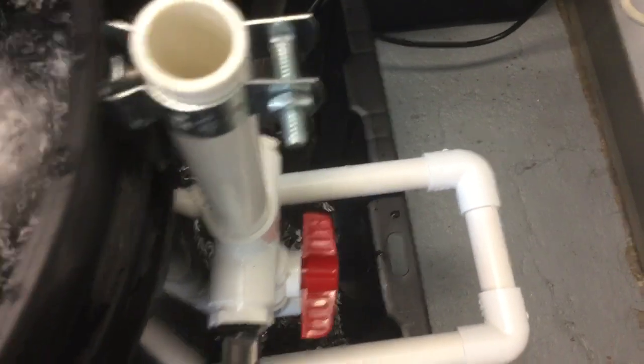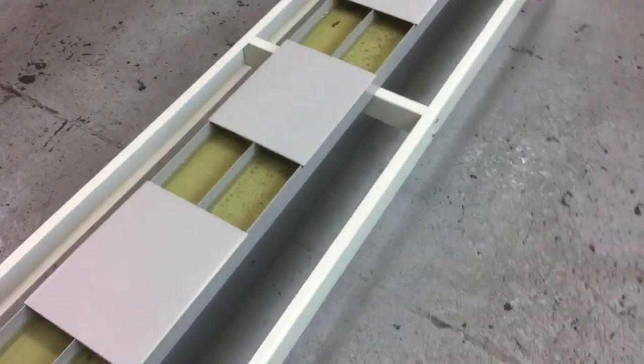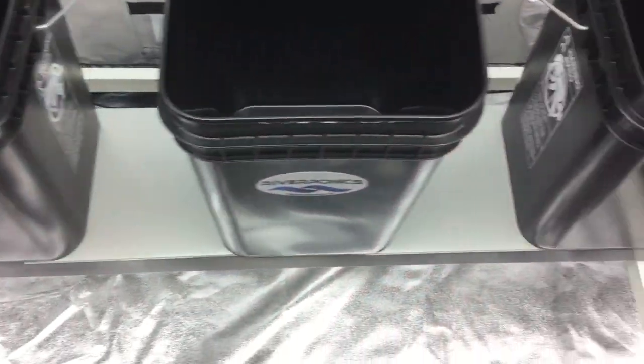I have the control valve on/off and I'm going to turn it to supply the fluid out to the grow tents, into the growing channels. There's a divider down the middle of these channels, open-ended on both ends, so the water serpentines through the grow channels. The water enters through the tube down below into one side of the channel, goes the whole distance, wraps around, then comes back through and drains out. A pipe connects the next grow channel, and the fluid comes up, serpentines through, goes all the way down the back, and ultimately drains back to the reservoir.